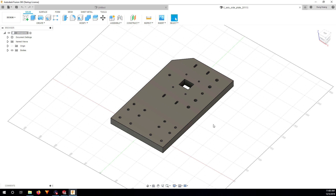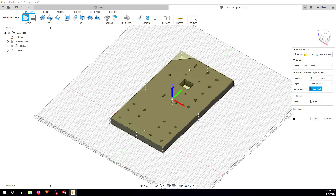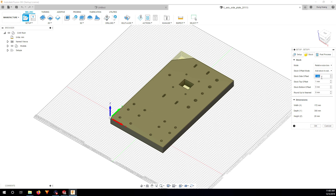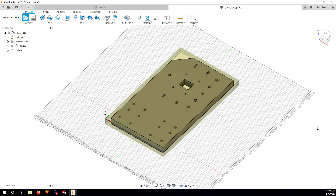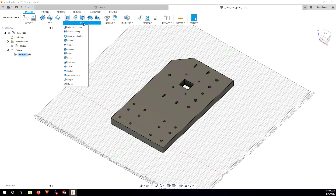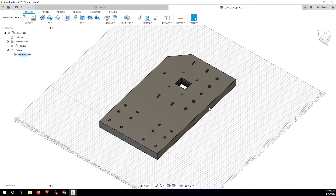If you use the 3018 CNC machine, you can use the first few steps to make the holes and pockets, then the last step to cut out the outline - or just cut the outline with a saw. First, go to manufacturer, go to setup, click box - I prefer this one. Here I put an extra 10mm margin because I'm going to cut the outline. If you have a 3018 CNC and won't cut the outline, just put zero.